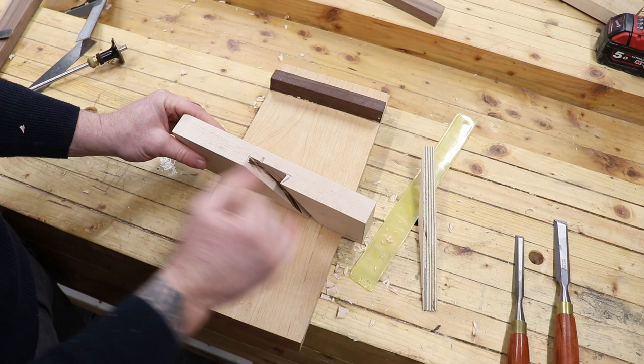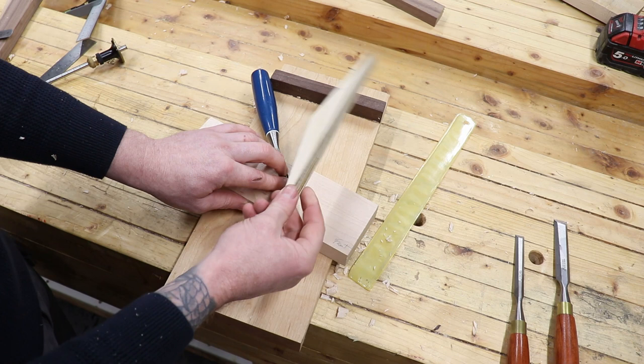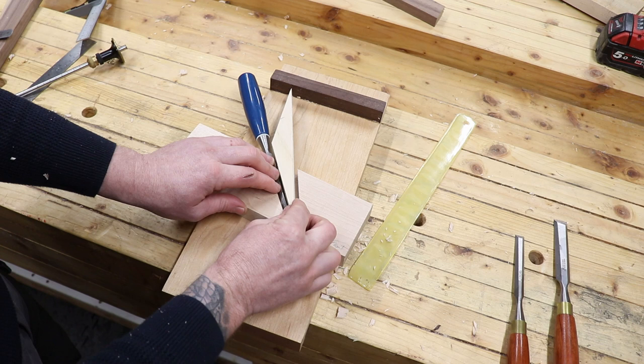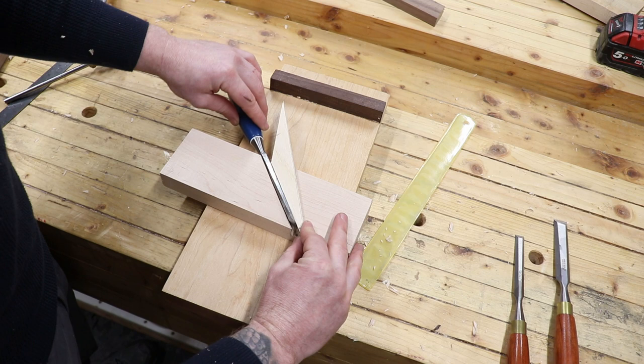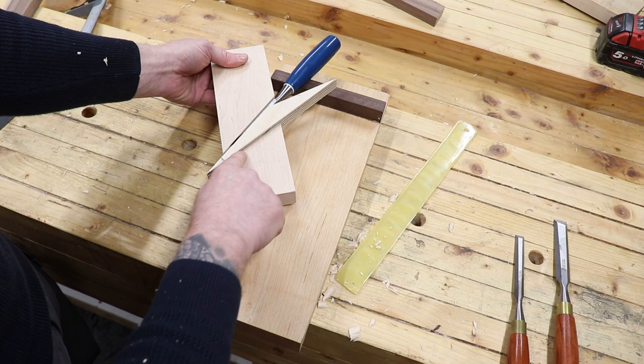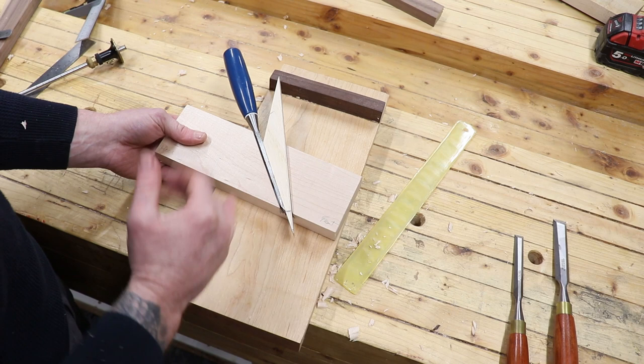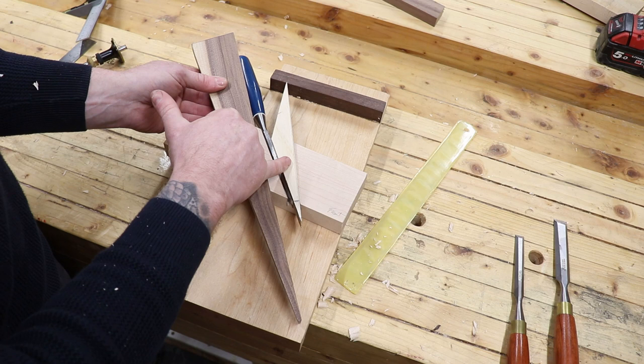That is our recess all cleaned out. I have a 10 degree angle back in the way and my 45 degree bed is perfectly flat. My chisel will sit like this on the 45 degree bed. I just have to trim the wedge piece back so it fits in with the chisel - it would have been hitting the chisel handle otherwise. If I set my chisel so the tip is flush with the base of the plane and wedge that in, you can see we have no gaps whatsoever - perfectly aligned - and the chisel is perfectly flat against the bed.